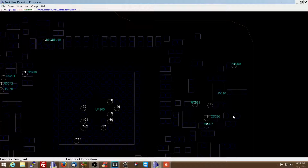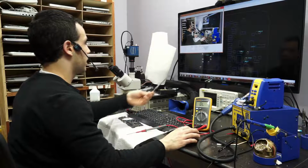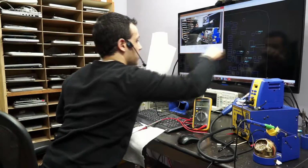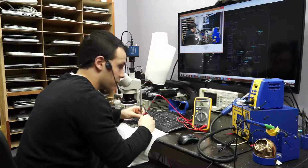So what I'm doing right now, might as well move some things around so that you can actually see how I'm troubleshooting, and also do that in the camcorder. I'm going to measure one of those little spots that I see over here on my multimeter. On the screen over here, it says that's a place where I can find PP3V42 underscore G3 Hot. So I have my multimeter in diode mode.